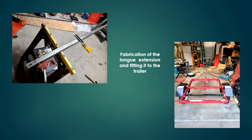Before I assembled the trailer, though, I did take a moment and sprayed clear coat on the entire trailer, because while the trailer is painted and finished, it does not have a durable coat and will fade in the sun, so by spraying the clear coat on it, that protects it from those UV rays.